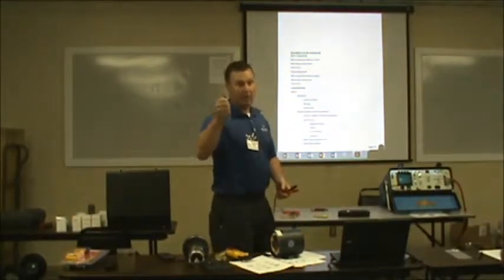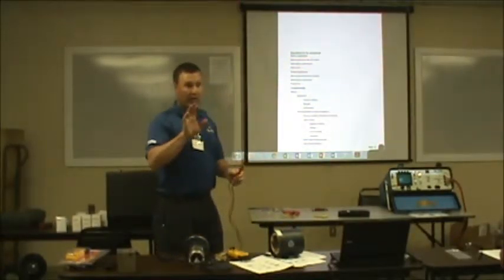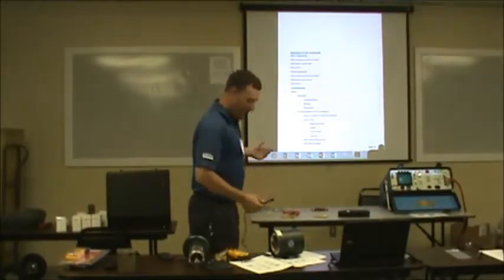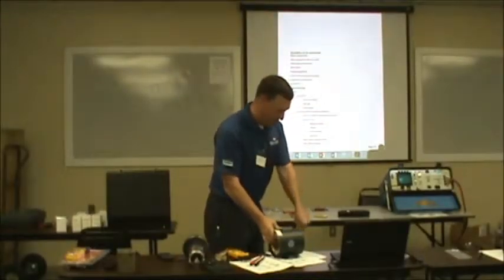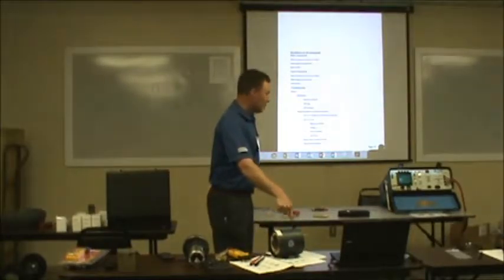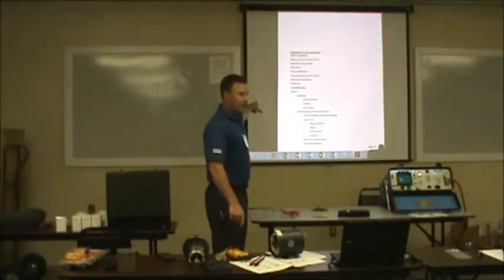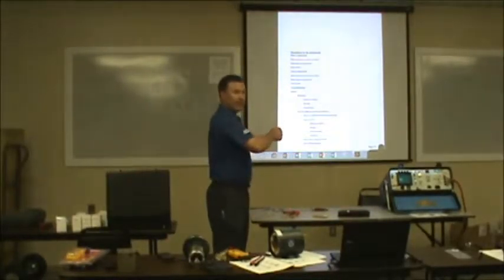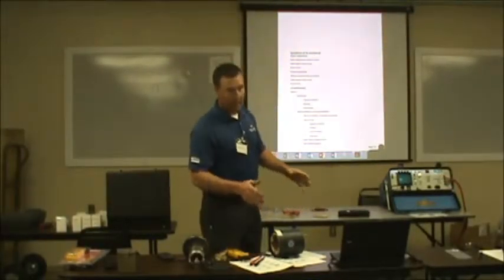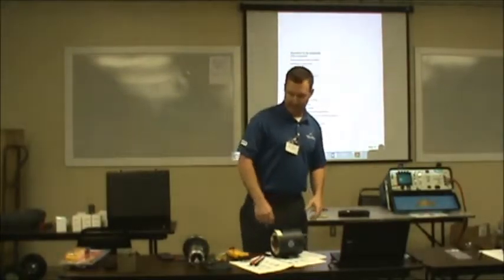Now, turn the power back on. Got the motor unhooked. This is where it can get a little bit unsafe when you're testing. Here we have got some leads coming in here. And we need to test voltage right here, because that wire runs through 200 foot of conduit back to the control panel. Well, if I check it at the bottom of the contactor, and I've got voltage, I've got 200 foot of wire that's not tested. So how do I go about testing this?